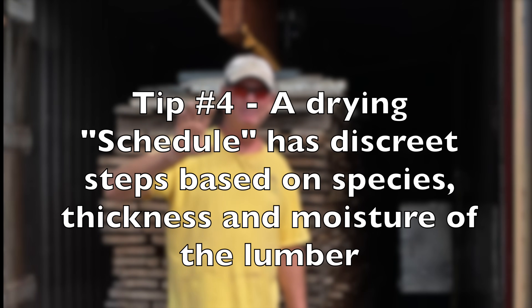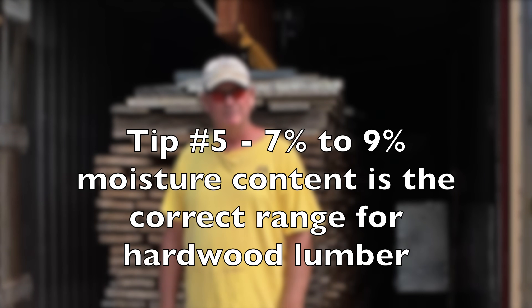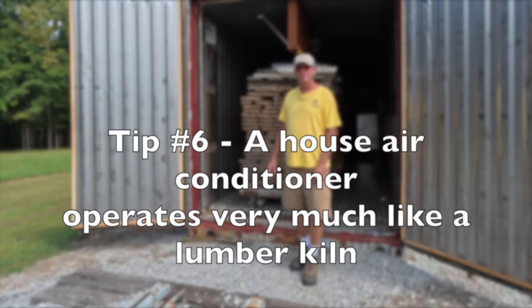You basically set the rate of drying based on the percentage moisture that the wood has at the time. You use what's called a kiln schedule to dry the wood at certain environmental conditions as the moisture drops in the wood. Eventually, you want to get it down for hardwood between 7% and 9%. I like to go to 7% because most houses are about 7% to 8%. That allows somebody to take my wood directly from our store, put it right in their house. As far as it's concerned, it's at equilibrium with the outside air inside the house. A house is a very good kiln — it basically operates in the same manner as one of these.